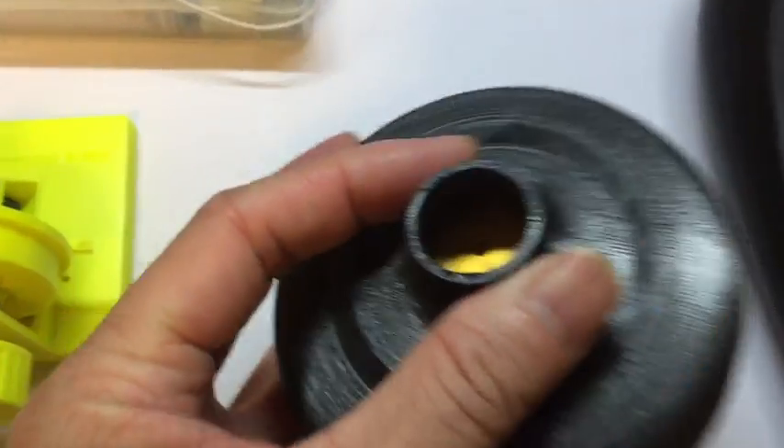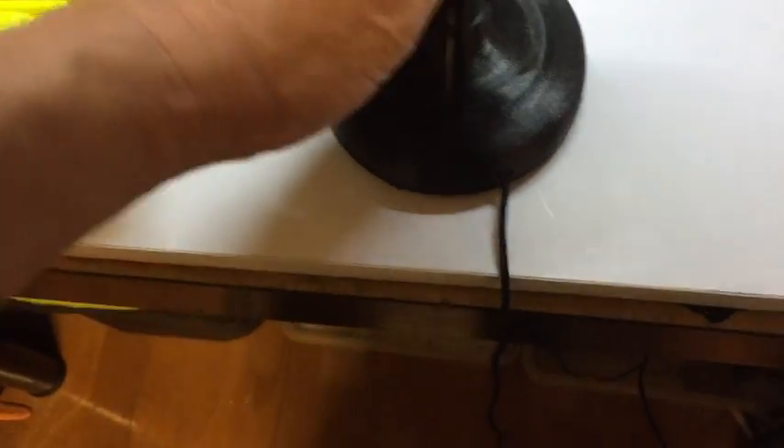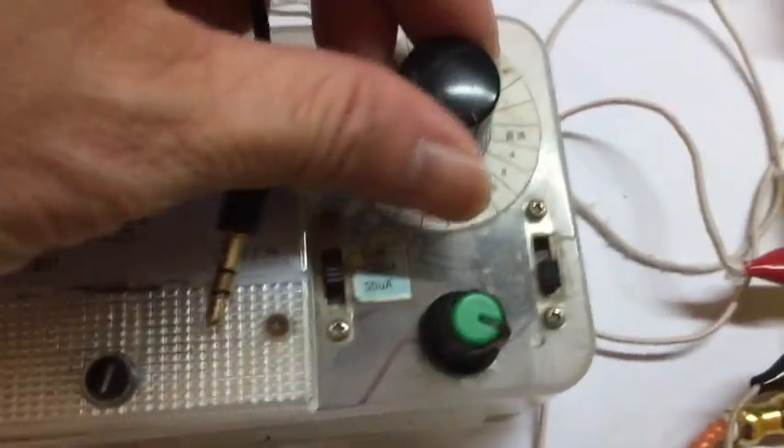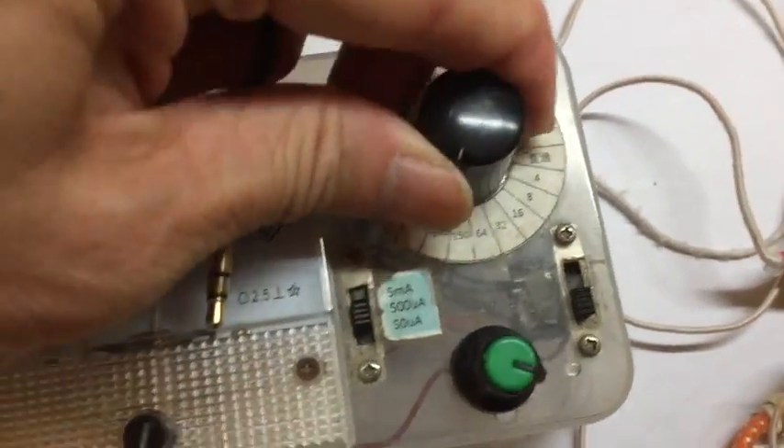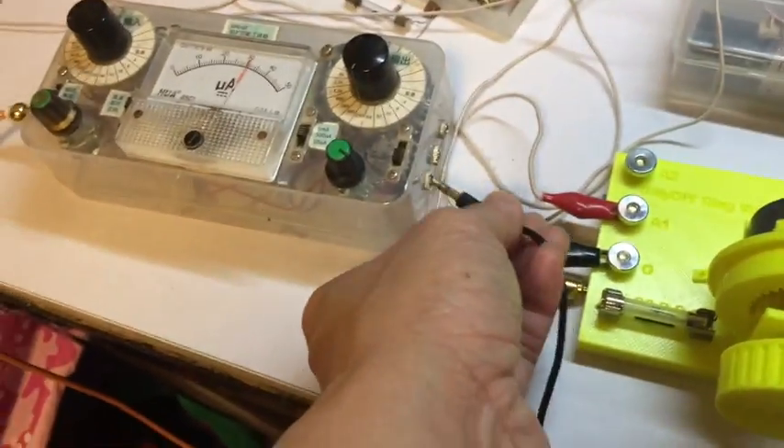Now I'm changing to this other sound unit. It's just a telephone handset mouthpiece — we bought this from China Taobao.com. Let me adjust my audio transformer to match the 350 ohms of the speaker.